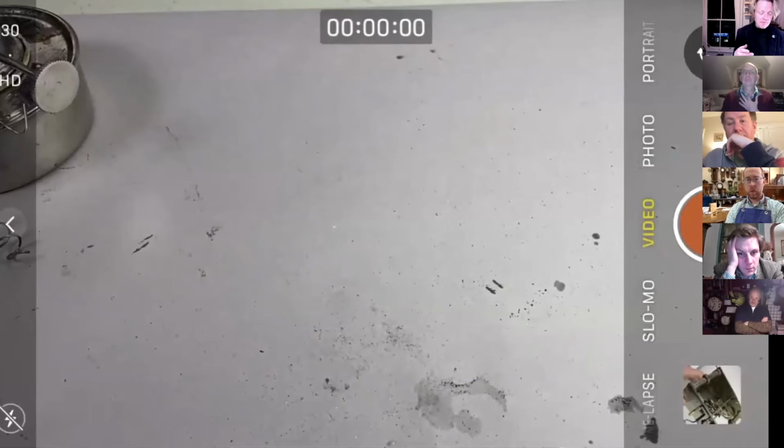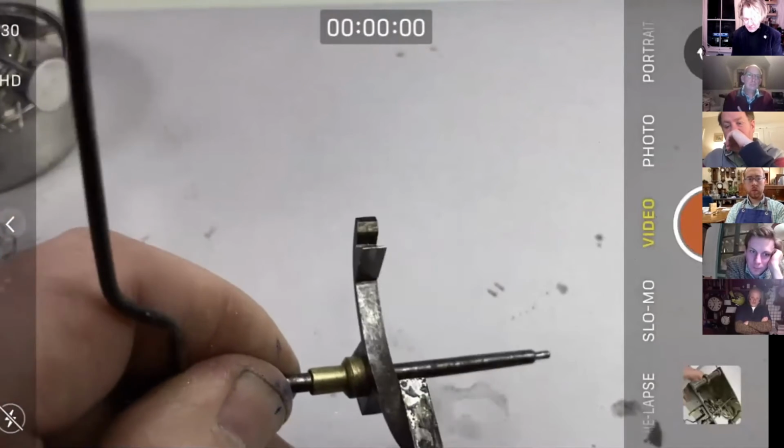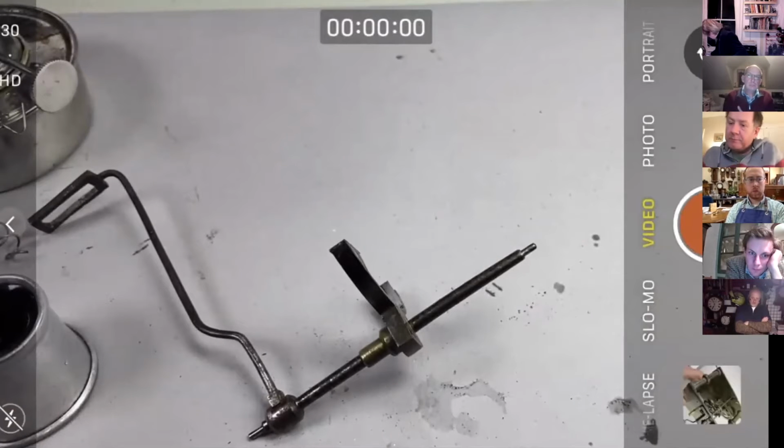And because it's gone on nice and straight, I'm actually going to leave it, knowing that there'll be too little internal drop, the escapement won't work at all, and we'll just use diamond files, because I've got new kind of diamond file things which are great, but I'm making a video about them. So next thing to do is to clear up this face, which has got flux and stuff on it, fire stain.